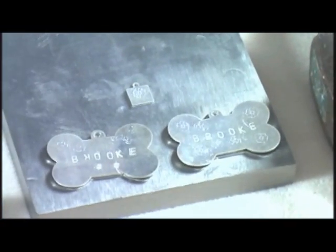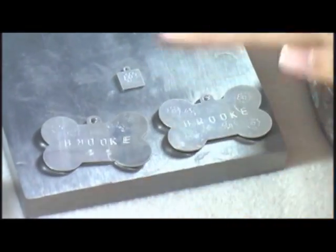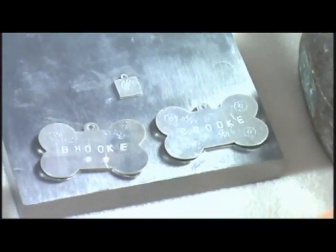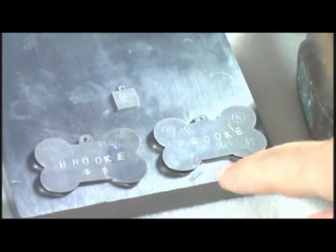These are some examples of some mistakes. Holding the stamp the wrong way, resulting in upside down or sideways impressions. Not holding the stamp firm enough, causing the stamp to move. Not holding the stamp straight or hitting the stamp too soft, resulting in incomplete images.